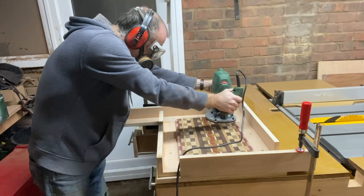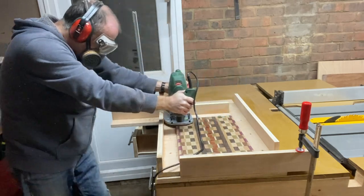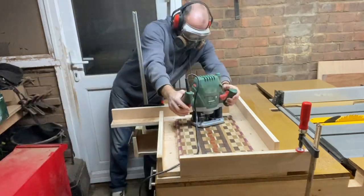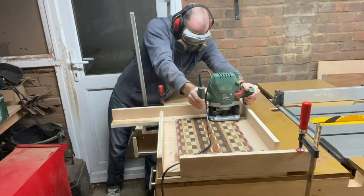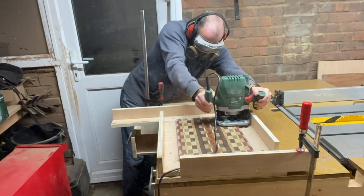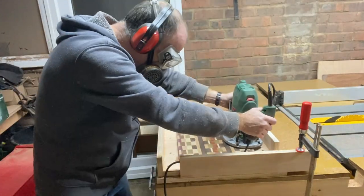I also noticed with the router sled there was a little bit of tear out — you can see on the strip of cherry there are marks from that. That's a real pain to sand out. Because it's end grain as well, and end grain doesn't sand down as quickly as edge or face grain, I was sanding for hours trying to get those bits of tear out out. But eventually we got there. Now it's time to do the juice groove, which went pretty well. I probably went a little wide — next time I'll go for a slightly smaller router bit for the juice groove, but it still looks pretty good.